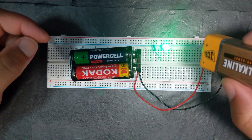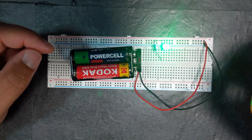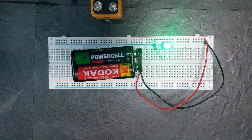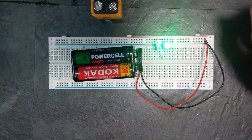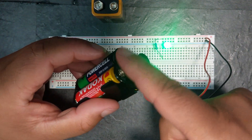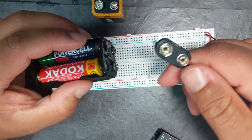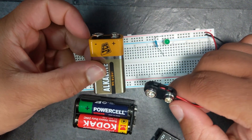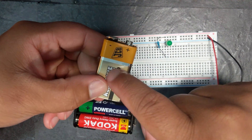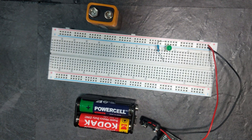So those are the four ways you could power breadboards. There is another way — you could use a bench power supply — but I don't own one yet. To summarize: the power supply module which you can get for £2.50, cheap DC adapters, a battery adapter, and obviously a nine volt battery. In the next video I'll show you why you shouldn't plug the LED in directly — that'll be fun. I'll see you next video, peace.